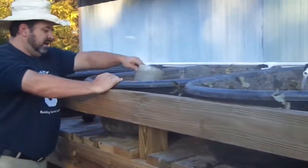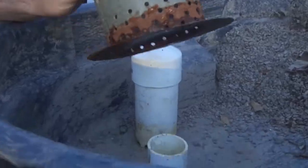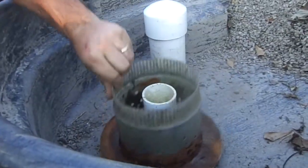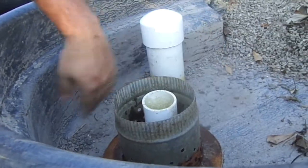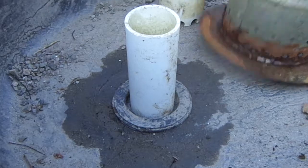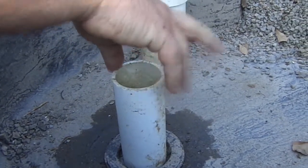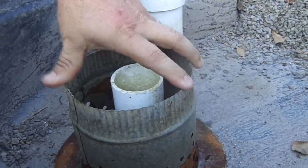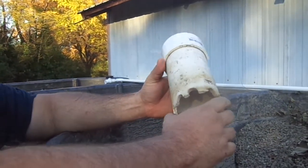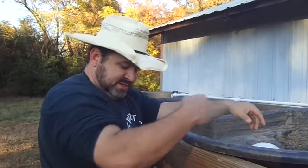Now remember when I was telling you about the ductwork thing? You've got your two-inch PVC pipe sticking up out here. You put this cap right here, then fill all the stone around it. This prevents the stone from getting down into it and eventually wallowing out and busting up the threads. Plus, when you have to adjust your level with this tube to get the proper vacuum, you won't have stones falling down into the tanks. You set it down like that, then put the stone around it. This is our cap for our vacuum. There are many different ways to set these up — you can drill holes in the bottom for it to sit and become a vacuum to suck the water up.